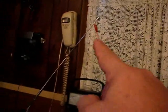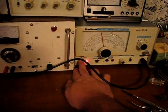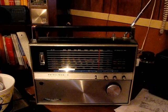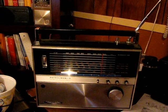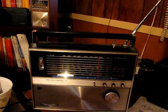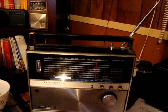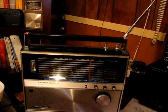I have it attached to the antenna lead, which is picking up. So let's turn this on. Now I can tune up and down the bands with that 455 frequency going into the IF, acting as a beat frequency oscillator, and we're able to tune in single sideband conversations up and down the 80 meter band.